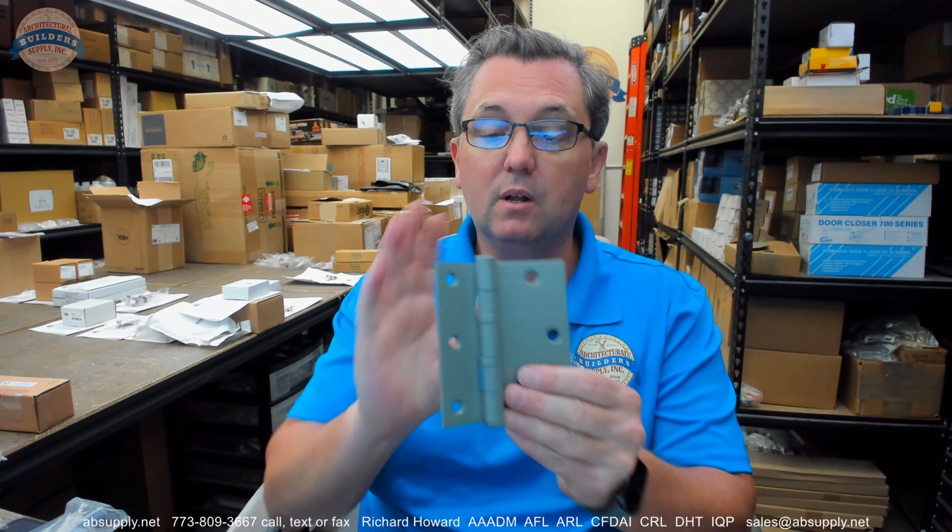Where would you use this hinge? A situation where you are surface mounting a hinge on the door that you are hanging in the frame. Why would you surface mount something? A lot of people will just opt for a surface mount because they have a problem with the door reinforcement or the frame reinforcement — possibly both. So you will just look to surface mount it. You will also see surface mount hinges used in installations where you are doing something atypical.